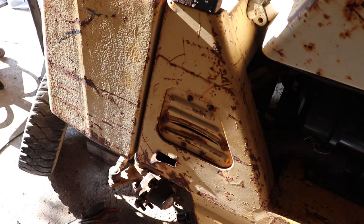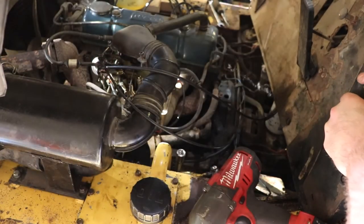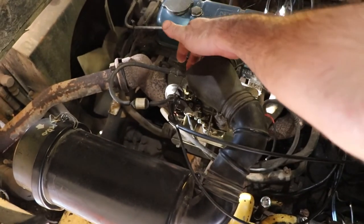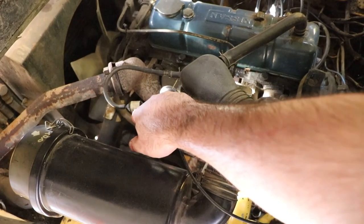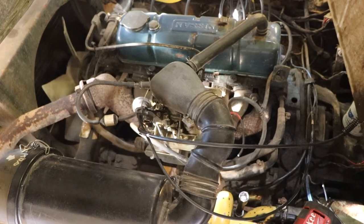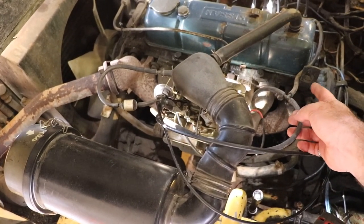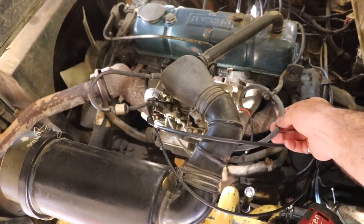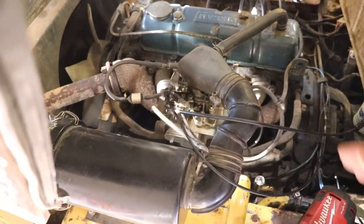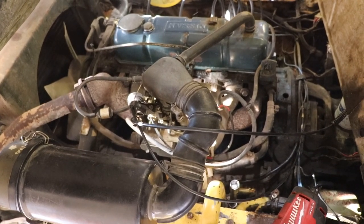It seems like the governor is not quite working correctly on this machine. The governor tube goes to a dash pot that adjusts the throttle, and that dash pot comes up to the intake so it can sense how much the throttle is open. There's a hose coming off the governor below the carburetor going onto a T which goes to the distributor and the intake manifold. There's no mechanical linkage of any sort between the governor and the carburetor. I think that hose is probably the way it's supposed to work, but I can't find any vacuum diagrams — if anybody knows about that please let me know. Thank you very much and thank you for watching.